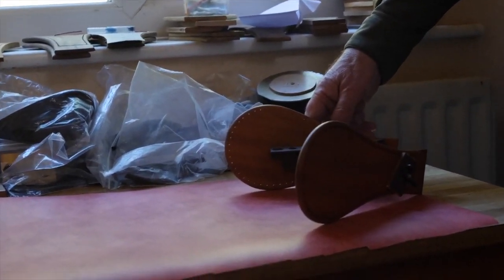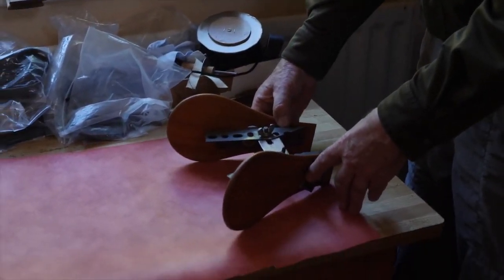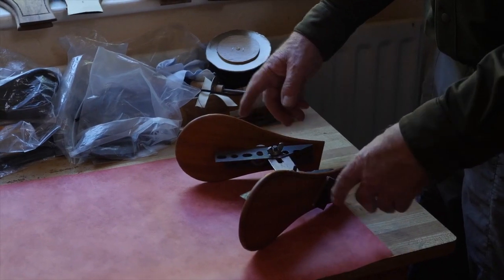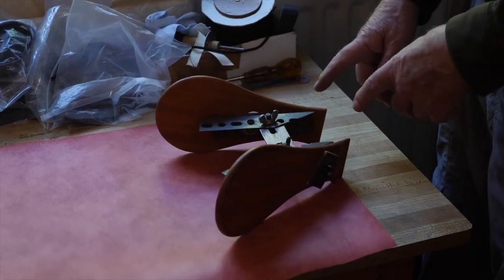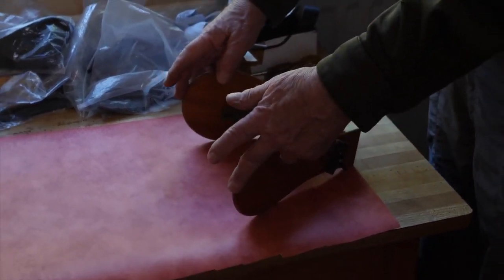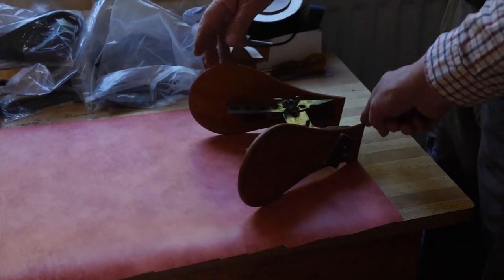First thing is, how do you work out the shape of the piece of leather that you're going to cut? Well, with curved bellows especially, I need a template, and this is the way I devised to make a template for curved bellows with bits of Dexion. So what you've done is you've fixed your two bellows cheeks into a former, the form that the bellows would be if they were fully opened, 3 inches across there and 9 inches across there.